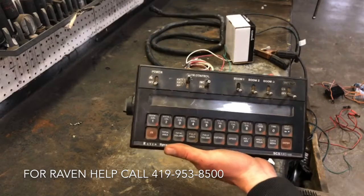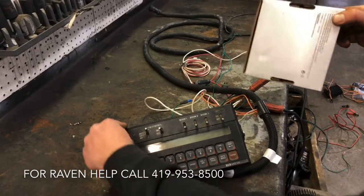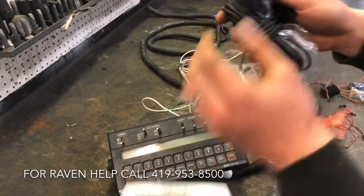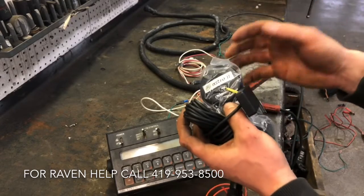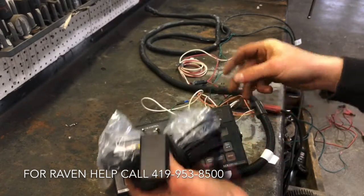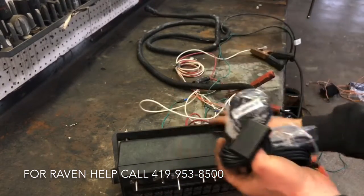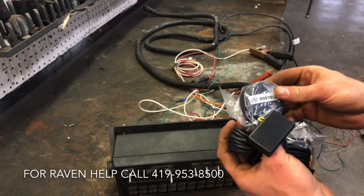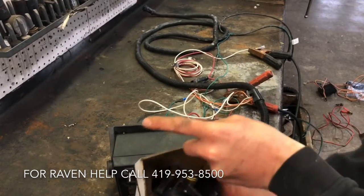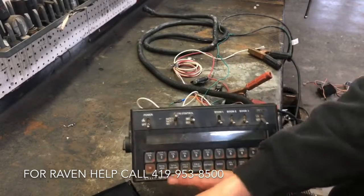Master power right here. The first thing I want to talk about is the speed sensor type. Speed is going to be your first hiccup — the first thing that typically screws up on these is your GPS speed. What I've got in my hand is a Microtrack Garmin Astro speed sensor. It plugs into the back of the Raven 440 right there. It's a very good and efficient way to get your speed. If your radar on your tractor is not working, I highly suggest having one of these on the shelf. They're very simple to use and fairly inexpensive. The first thing everyone has trouble with when they first get out their 440 is it's not reading speed, so that's the first thing I wanted to touch on.